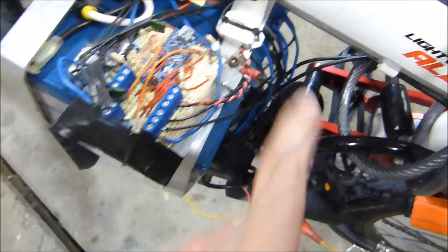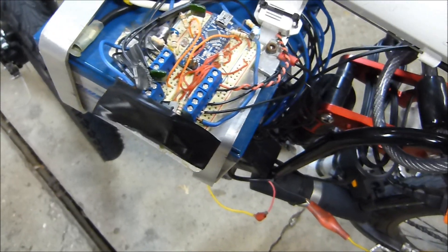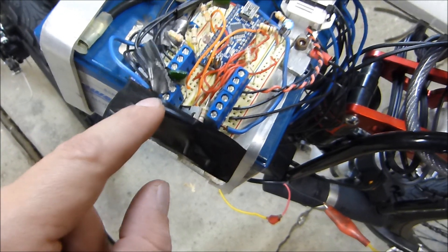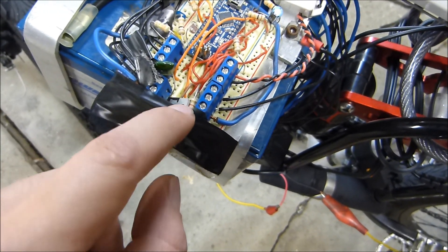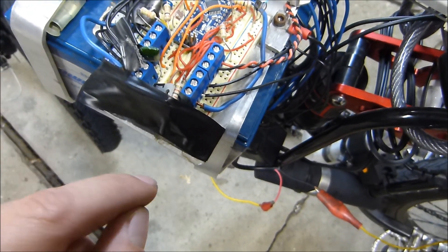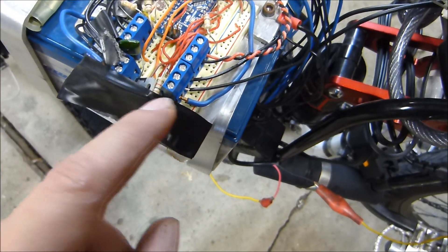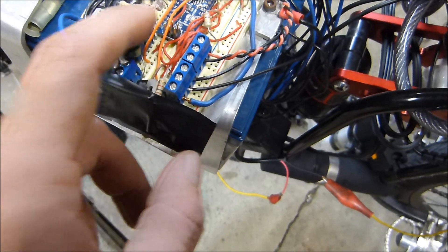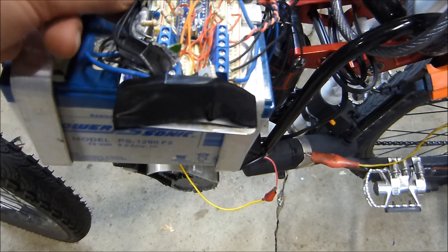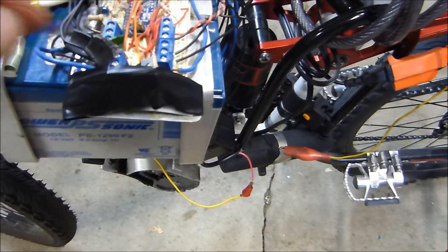I also have a little startup buzzer. Onboard 12 volts comes from the DC-DC converter, and then here's the 12-to-5-volt converter for some of these sensors and accessories. There's a little light sensor for timing the brake light blinking — there's a little automatic blink going on there. There's also a cruise control input.